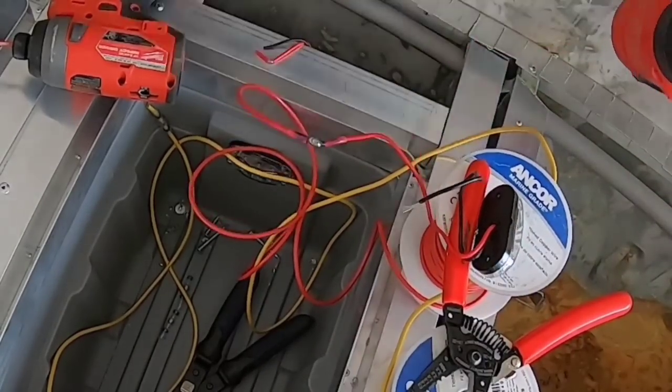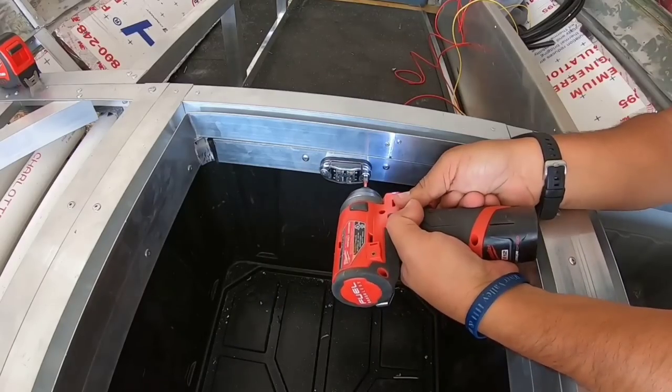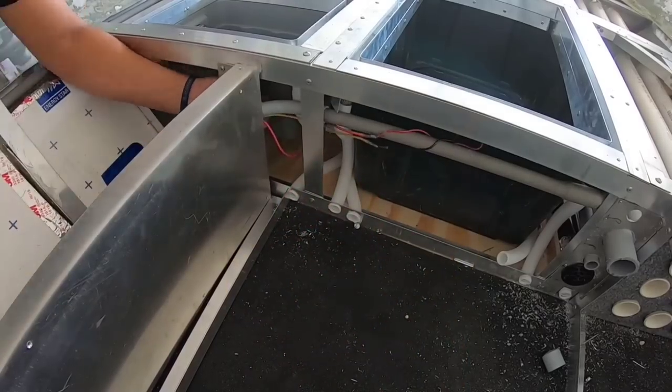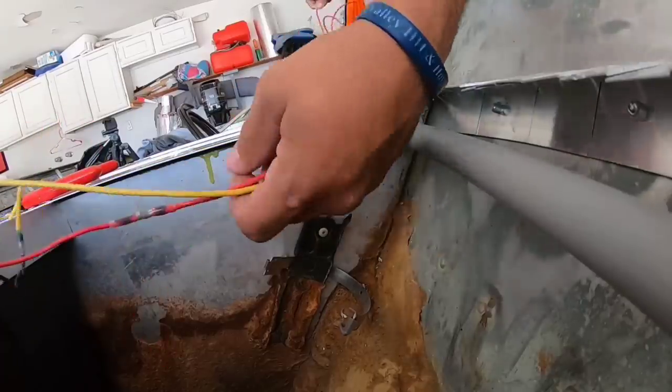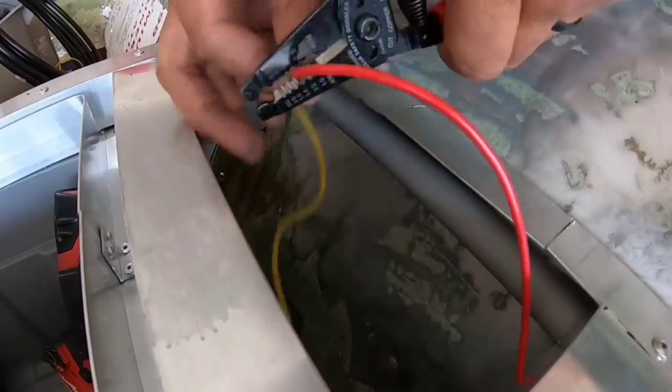Here we're running these self-soldering connectors. I find them to be the best thing because they solder the wire together instead of a crimp, and they also have little adhesive spots that blend. It does everything, and it's super flexible. Doesn't add any real extra bulk to the wire. So if you're trying to run the wire through places like this, the butt connectors don't get caught.